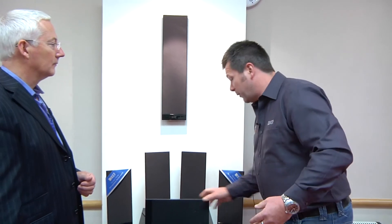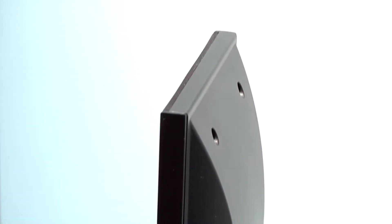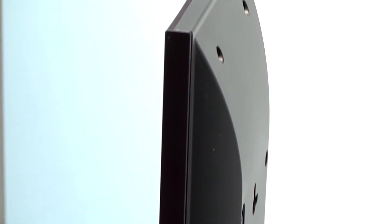Although the box is relatively thin — its overall depth is just 35 millimetres — we're still achieving very good bass levels from the speaker, down to about 100 to 110 hertz, which is remarkable for such a small loudspeaker.